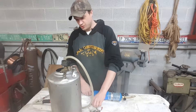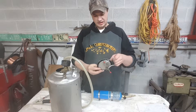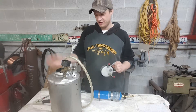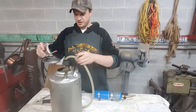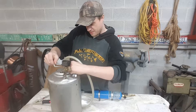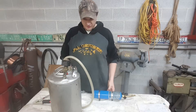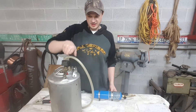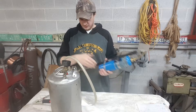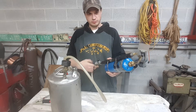To get it going, all you've got to do is pour your fuel in through here. It's got kind of a weird lid — a nitrile rubber ring that goes around it and seals against the top of the tank. Once you're fueled up, you put that in there, make sure it's firm against it. Once you've closed the valve off so it doesn't let the air back out, you are ready to go. You just open the valve on the propane, light the pilot flame, hold the gun like this, throw that valve open — boom, done. It ignites every time.